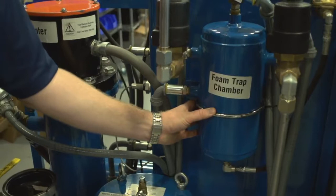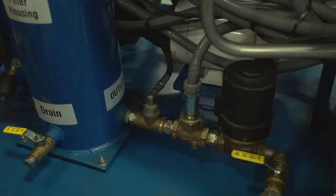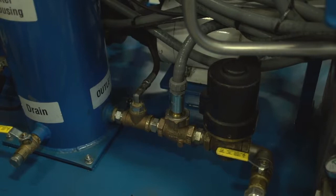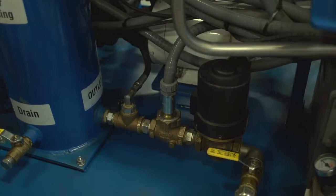This foam trap has an automatic recirculation system that comes standard, meaning that if this chamber were to fill up with foam it will automatically activate a system that pulls that foam back into the vacuum chamber. A key feature of the DeskCase Hivac system designed for transformer oil is the positive shutoff solenoid valves — electrically activated solenoid valves rated at 300 psi differential, located at both the inlet and outlet of the system, positively isolating the vacuum dehydration degasification system from the transformer when the machine is turned off.